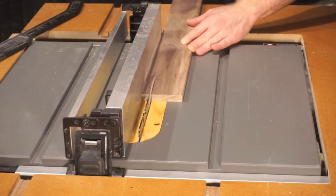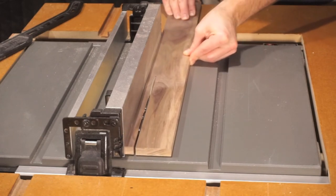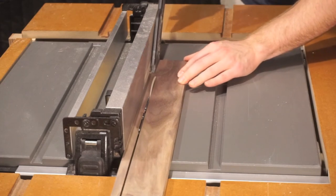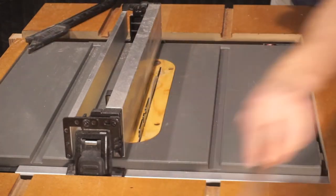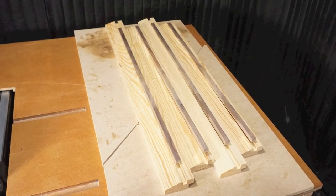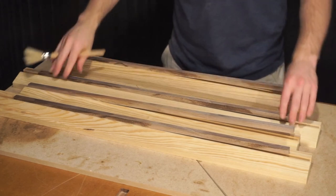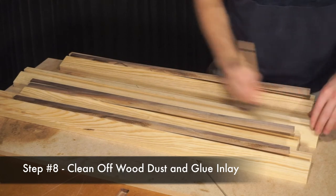As you watch this video, don't forget to smash that like button and also subscribe to the ShopFix channel if you haven't already. Thanks for your support. Let's continue by finishing this rip cut and then taking our inlay pieces of walnut and fitting them into the slots we just created in the pine frame to test fit everything out. If you followed the steps that I outlined, you should get a perfect result with a very snug fit. Then all you have to do is wipe off all the dust and simply glue the inlay into the pine frame.